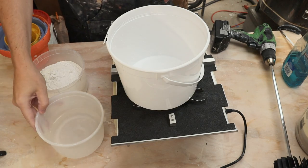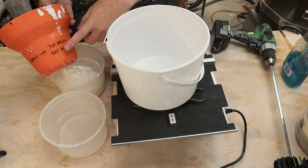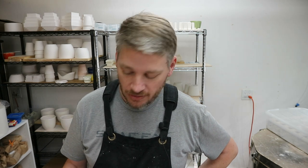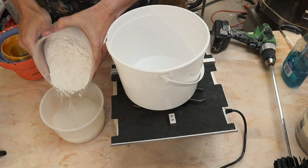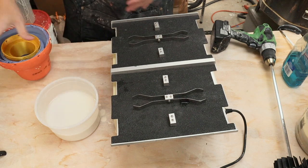With that background, let's set up and pour a plaster mold. I went ahead and measured out my water and plaster. I wrote the amounts on my 3D printed shell so I don't need to remember — highly recommended. A while ago I made a video testing different ratios of plaster to water and mixing time, so I'm using those results here. First up is to slake the plaster — I take the dry ingredients and slowly dump them into the wet. This will sit for three and a half minutes, and while it's slaking let's go ahead and put the Windex on the mold.